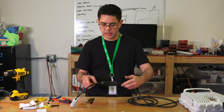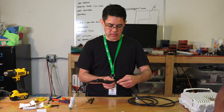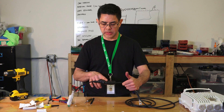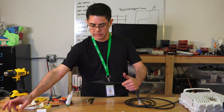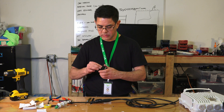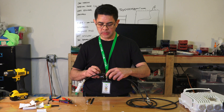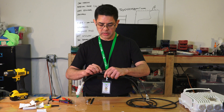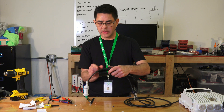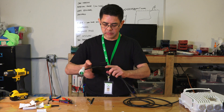We're completely sealed now — going from the outer jacket all the way down, completely covering the connection. The next step is to put three layers of electrical tape on the outside. Start on the actual cable jacket, at least one inch or about 25 millimeters beyond the edge of the butyl. As you come around with the tape, overlap about half the width of the tape. Make three passes over this.